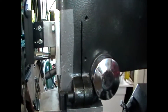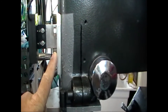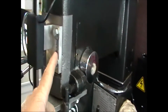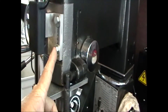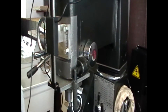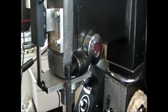It's a relatively simple project, though it did take some time. I machined all the pieces from quarter-inch thick aluminum — you could go thinner, thicker, or use steel; I just had the aluminum on hand. Instead of drilling holes, I wanted to be able to adjust it up and down, so I milled a slot instead of just two holes. I did some video of the milling and drilling which I'll put right after this, though I didn't capture the boring of the holes — I apologize and I'll try to include that in another video.